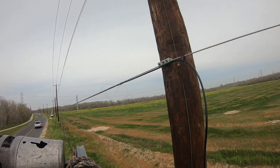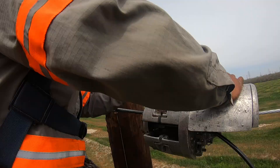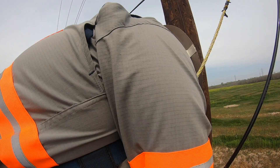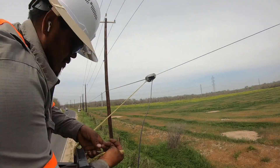I'm reloading — I basically grabbed one lasher, got another one standing by. The girl handed it to me, boom, goes back on the line. I put up a bug nut and then place the lashing wire onto the strand.